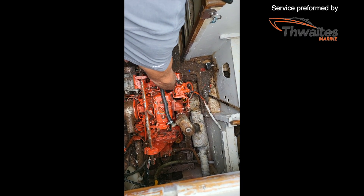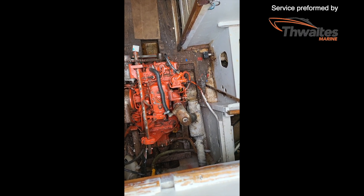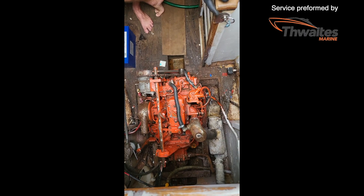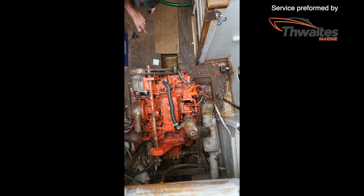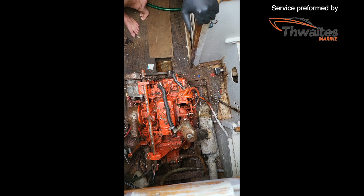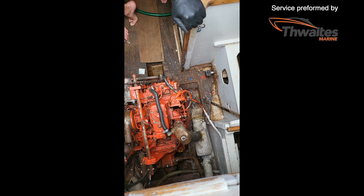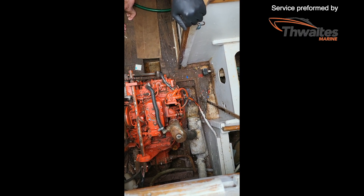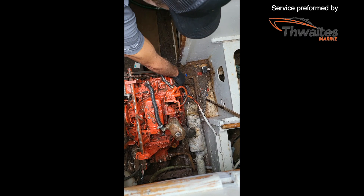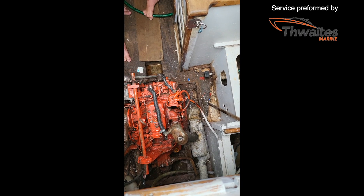This seems to be keeping itself cool and controlling its temperature — thermostat seems to be working. We need an impeller doing; it probably needs a new impeller because it's probably pretty old. There's a box over there with bits of air pipes. She's certainly got good compression and the oil alarm works, which is nice.